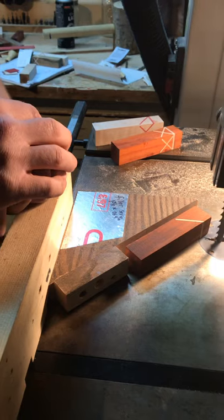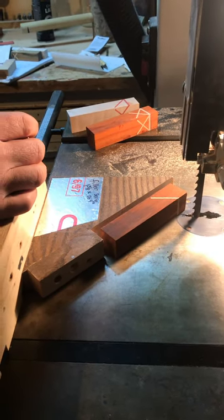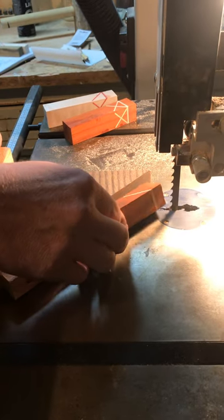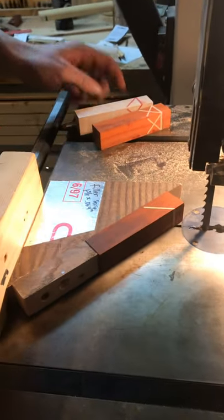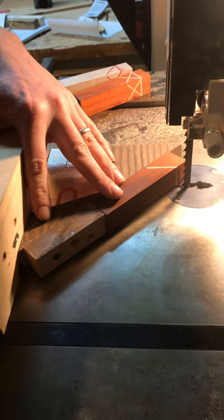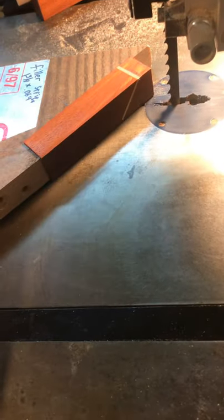At this point you've made your first saw cut, glued a piece of wood in, sanded it flush, and now it's time to make a second pass. All in all, you're actually going to make four passes. And sometimes after you have one or two slices of wood glued into your blank, it can be confusing which orientation you should have the piece in. So just take a look at it — if it looks like you're about to saw out a piece of wood that's already glued in, you've got to rotate it again before you put it in.